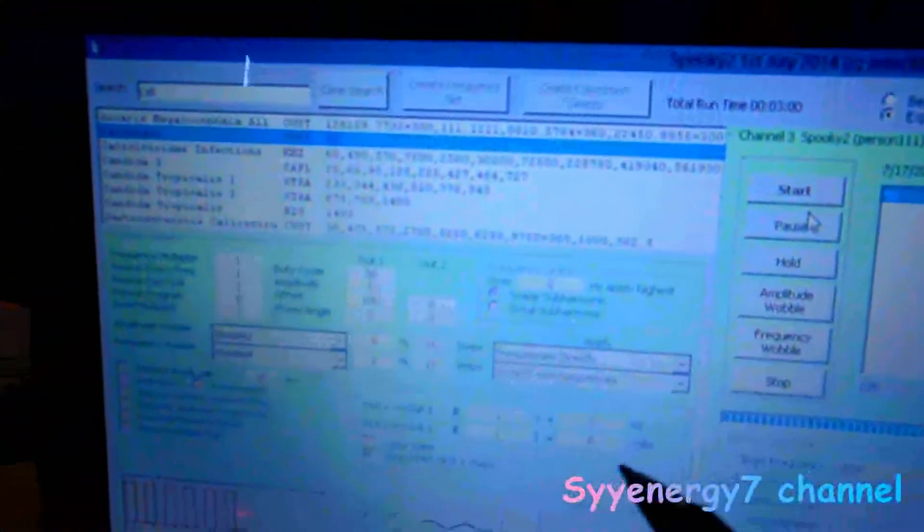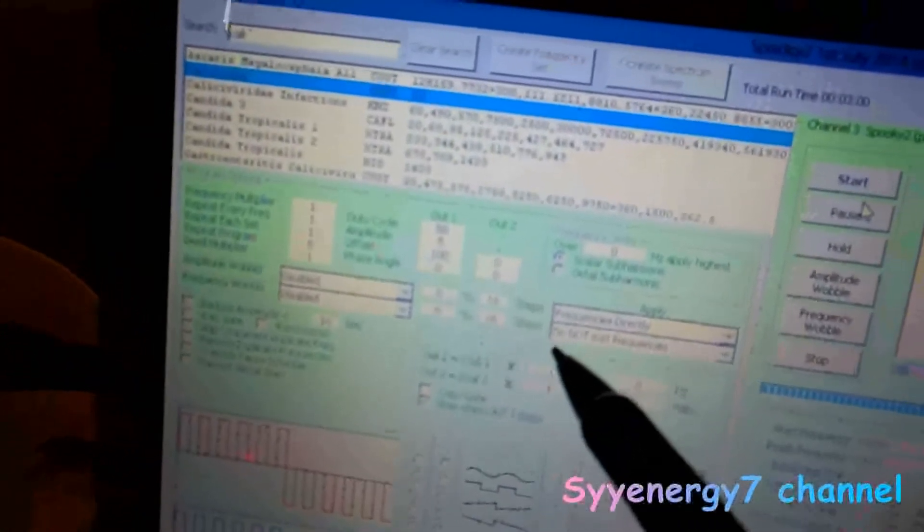I'm thinking that's probably your best setting if you want to use 100% positive offset. It's real simple — you can set it a couple different ways, but the simplest way is just add F1 to F2 down here. Follow out one. The spike plus sync settings are irrelevant — they're checked off, it doesn't matter. You just put 100% on out one because out two is following out one. If you do it other ways, it moves the whole thing up and you're not really getting down to zero volts on the main part of the wave.